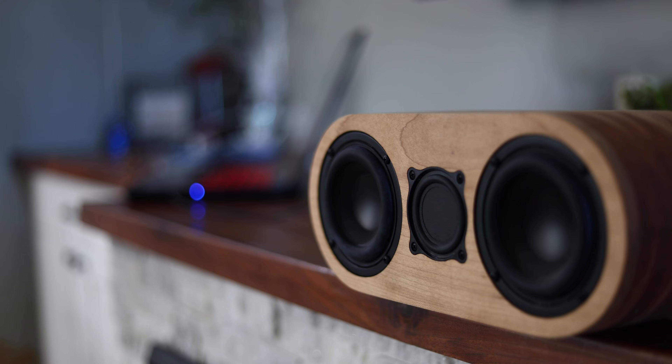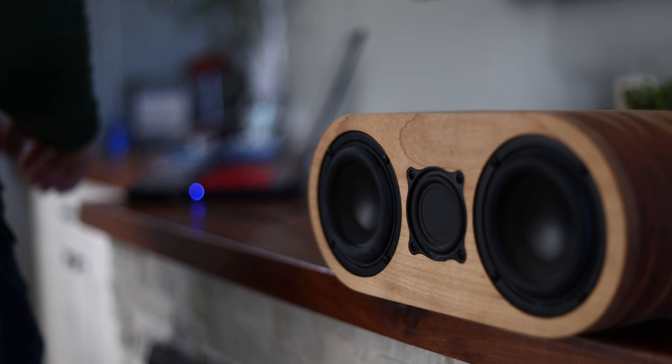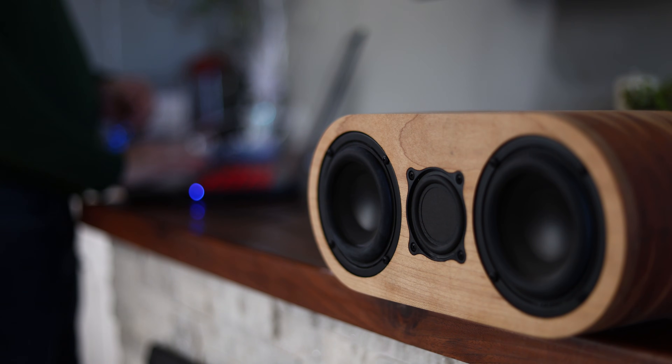In this particular test with the Rule Breaker, I would say this is absolutely listenable. Listening to both the 3D printed and wooden versions, I really didn't notice any major differences, even in that bass decay region around 60 hertz. Also, since this speaker is designed as a center channel for home theater, you're going to be crossing it over between 80 and 120 hertz, so 60 hertz will be on the downward slope — meaning the amount actually playing through it will be relatively low.